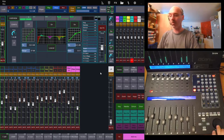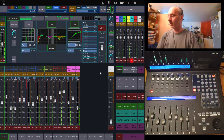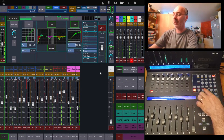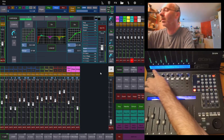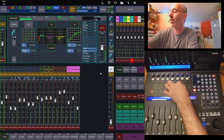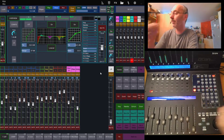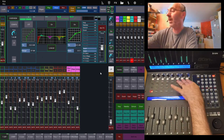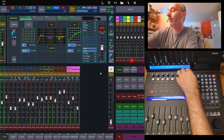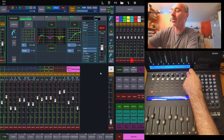The jog wheel in the normal situation controls — you see it on Mixing Station — my headphone volume. Now let's go into the special things. This row here is my different modes. The pan mode and the other modes normally control the encoders up here and the first row of buttons. Pan mode: the first row is sends on faders on the eight most used buses. Encoders control pan, and encoders can be pushed to control the gain — push again to switch back to pan.